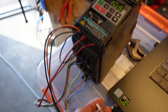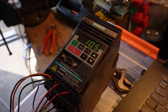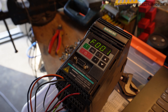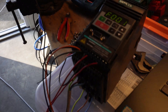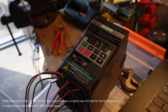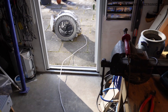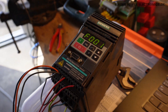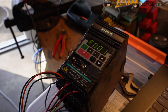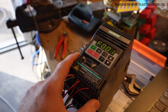I try to start it with the switch here — well, it starts turning. I can try to turn up the frequency, and then it goes into some fault mode. It keeps running... okay, this time it's actually stopped. Acting up very weird. I can start at a higher frequency, let's say 17Hz, and it flips fault 1 again. I think the washer motor is actually damaged — this is also the washer from our flooding of the basement, so water did get into that motor. As we could also see from the PCBs, they were actually water damaged.